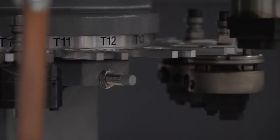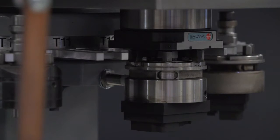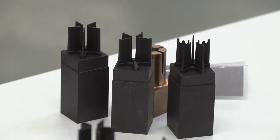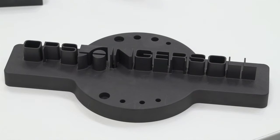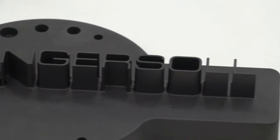Are there any performance benefits to this type of machine? Absolutely. OPS Ingersoll have worked for many years developing a generator — they call it the Eagle Tech or Eagle Power. This is fundamentally working with the mould making industry as the main focus. Looking at graphite: mould makers like to produce graphite electrodes very, very fast. The wear factors from this EDM technology are absolutely outstanding. Instead of having to make five, six, or even seven graphite electrodes as was common 10 to 15 years ago, we're now in an area where one or even two electrodes are sufficient for the manufacturer.